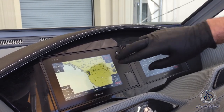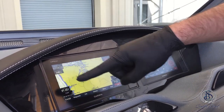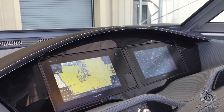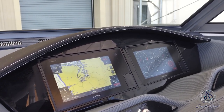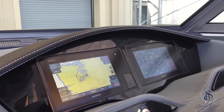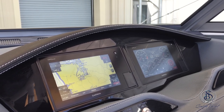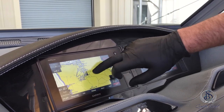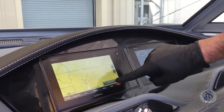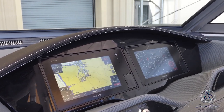For the maps side, you can pinch or pull to zoom in or out, or use the plus and minus. There are certain displays in the corners of the maps depending upon the options selected in the boat. You can create waypoints, set up certain routes you want to take, and set where your home is. If you're off into no-man's land and can't scroll back to the boat, touch the screen and the stop panning button will pop up. Press that and it'll take you back to center on the boat.